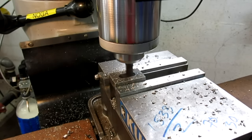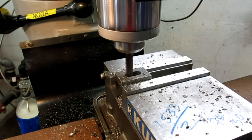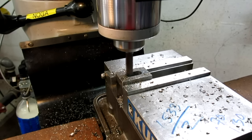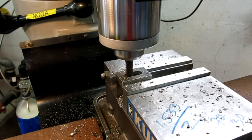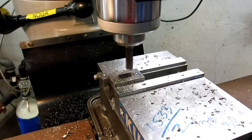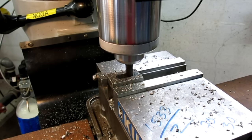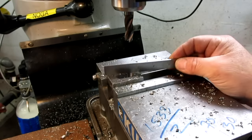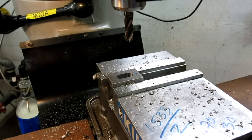It's through now. I could hear some chatter, so I'm coming back out and returning to my original spindle speed of 700, then cutting each end with a Z-plunge, which is much more cooperative. Over to my other mark at 1.3 inches, same thing - very nice and mellow, nice and straight. So it's a little over an inch total. The valve lug on the water valve is about 3/8 by 1 inch, so this slot will make it easy to put on. He's going down a hole to put this on the valve actuator.